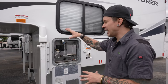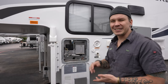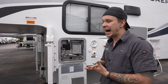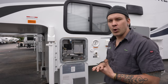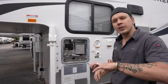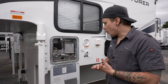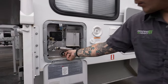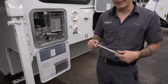Once cooled, depressurize the camper by turning off the 12-volt water pump if running off the potable tank, or shutting off the city water valve. Then go to the hot side of the nearest fixture — in this case the outside shower — and open that hot line to open the check valve and relieve built-up pressure. After that, use a 1-and-1/16th inch socket and extension to remove the drain plug, and the remaining five and a half to six gallons will evacuate the tank.